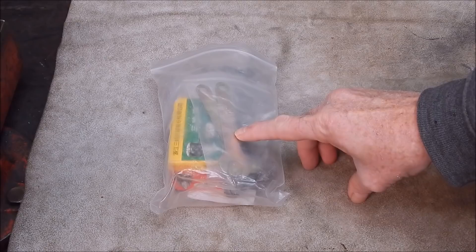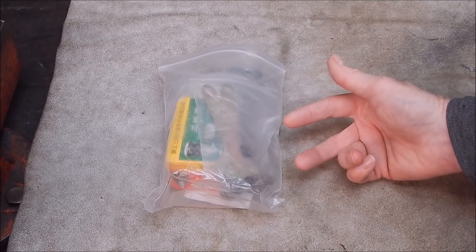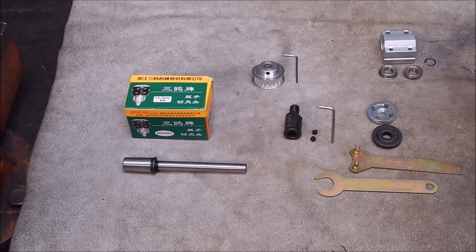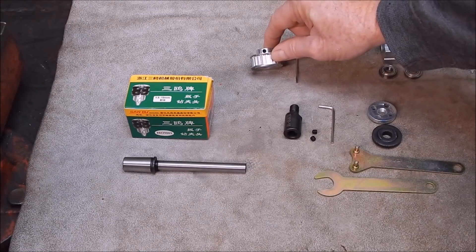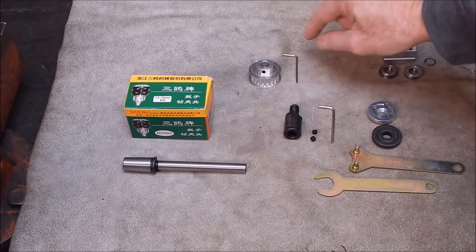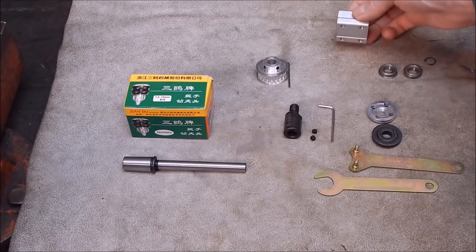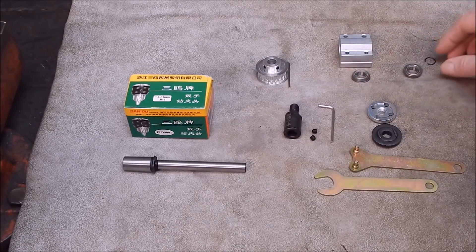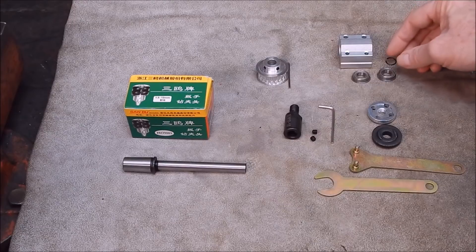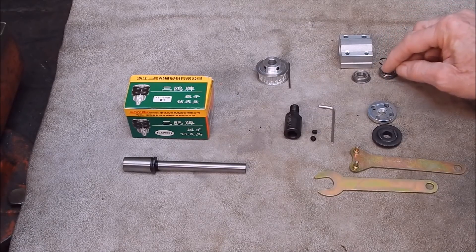There are four basic configurations for these combined packets — they're all identical except for two things. Each packet comes with a pulley, which is a gilmer-type tooth belt pulley — a positive pulley — it has a grub screw and a key for the grub screw; there are actually two grub screws. You also get a bearing housing that takes two sealed lubricated ball bearings, plus a little separator clip that goes on your 10mm shaft so it can stand proud of the bearing centre if necessary.